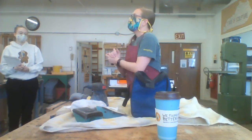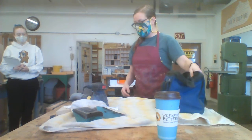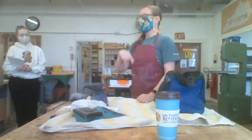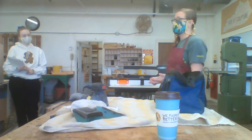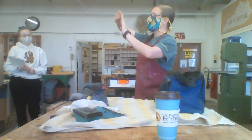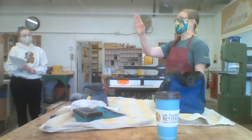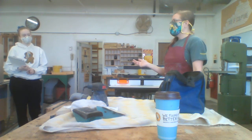In some instances the best thing to do is power sand. Typically I don't do this unless I've got a really broad area to cover, or if my grain changes direction a lot within a piece. The best example would be big picture frames — your next assignment is essentially frame making. You have a side that comes up one way and meets another side, and they change direction 90 degrees right at that corner. So if you're hand sanding, it's almost impossible to stop at exactly the right spot to avoid scratching into the adjacent piece.